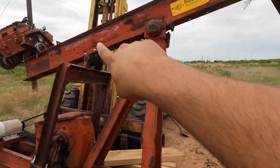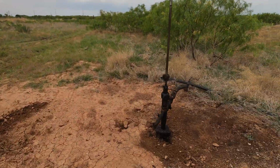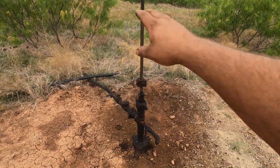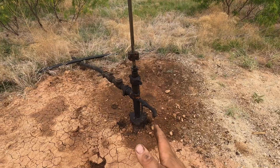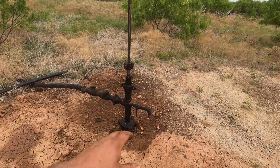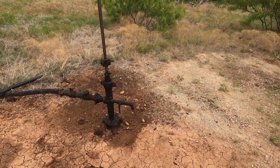The bolts broke in the tail bearing. It just went all to pieces. Anyway, it bent all of this forward and ruined the liner and the polish rod, and the tubing sort of looked a little bent to me, but maybe it's all right. Anyway, this is the first one that tore up. It's the last one I'm going to get fixed.